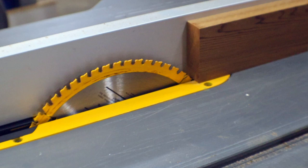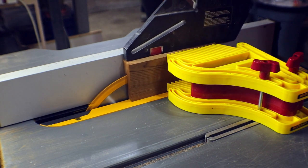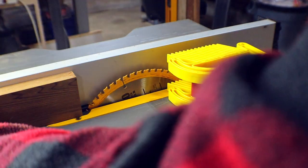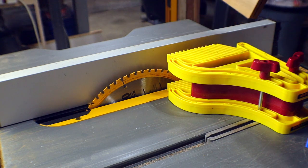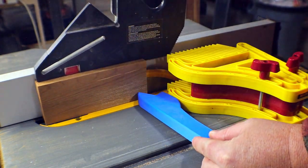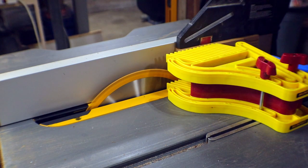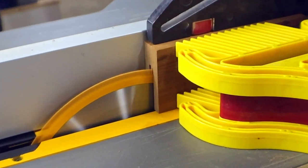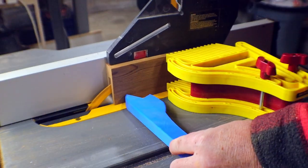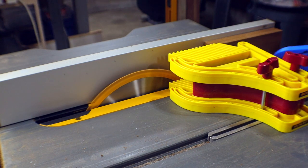Here's an easy way to center a channel using the table saw: place the fence so the blade is almost center on the stock. It doesn't have to be exactly centered. Now run it through once. For this task I did add some feather boards because the piece is fairly tall. After running it through once, you can rotate the piece 180 degrees and run it through again. That should have it good and centered. As long as your channel is wider than the blade, this should work for you. For this channel I needed it quite a bit wider than the width of the blade, and I ended up with a small scrap in the middle that needed to be cleared out. So after I'd cut a channel in all my pieces, I adjusted the saw to clear out that bit in the middle.